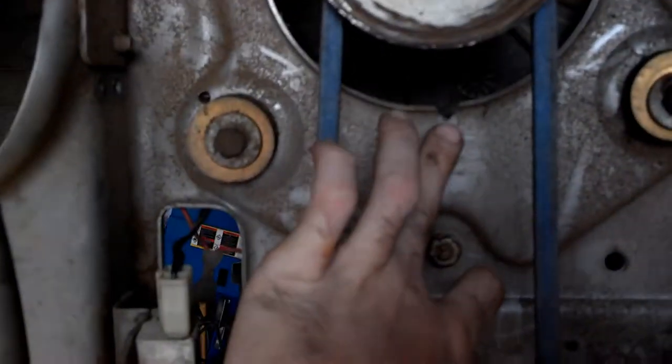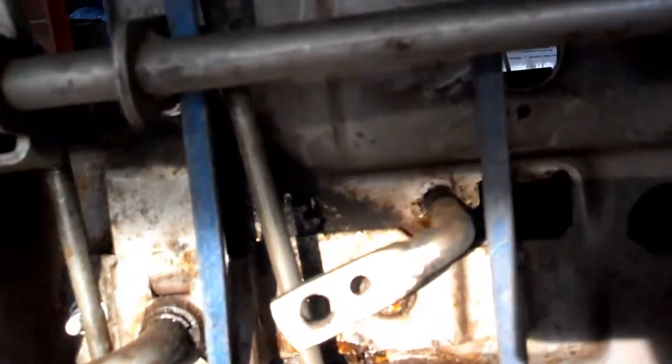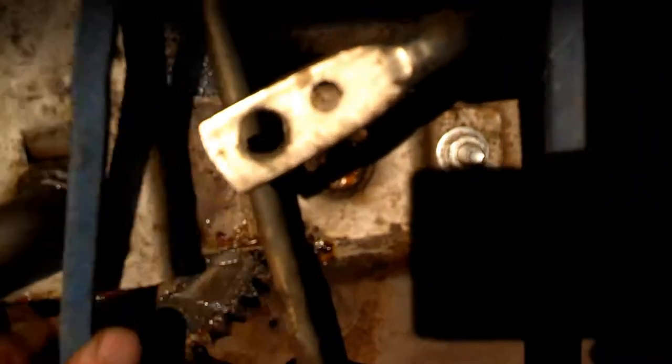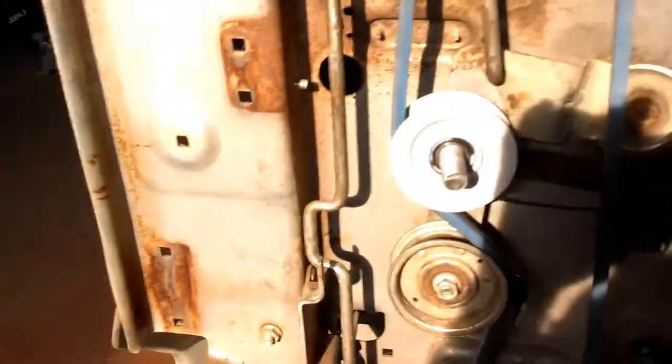This had to be trimmed off. The problem I've got now is the belt sitting here — I took the spring off of here, which went from here to here, and that was for the clutch to engage the deck. This does work — let me lock this for you. The belt is pretty loose, it hits right here. Let me take that brake back off — it's tight. I've got two springs here right now.